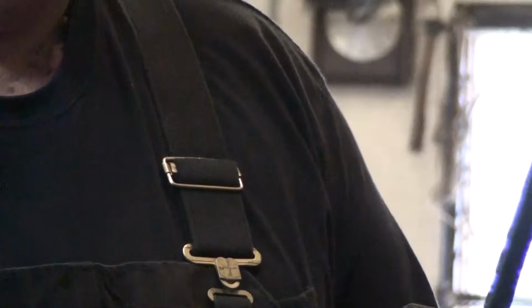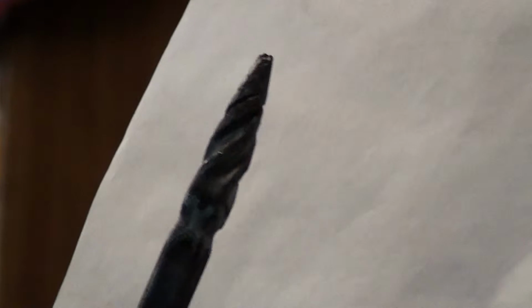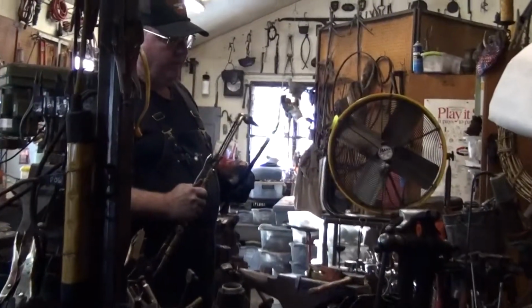Now with most hollow form fullering operations, it's a matter of easy does it. Go slow at first, get the line of collapse well established, then you can speed up as we work further along. You can see I've barely broken the corners at this stage, but I can see it is in the right position. Gives me a little narrower target for my torch heat, and we'll try to get about halfway to finished on the next heat. Okay, I've turned the torch up a little bit.